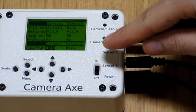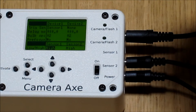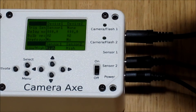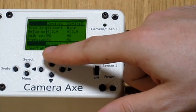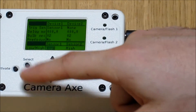I know that the light sensor will read a value of 999 when the laser is shining on it, and a lower value — the ambient light in the room — when the laser is not shining on it. So we want to take a picture when it goes from a higher value to a lower value. This low-high setting means where you want to trigger, and we want to trigger when it goes low. So I'll change this value to low.